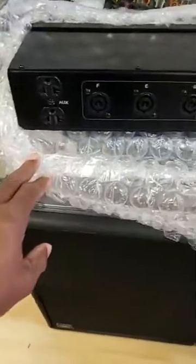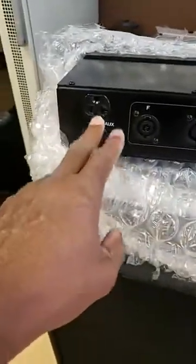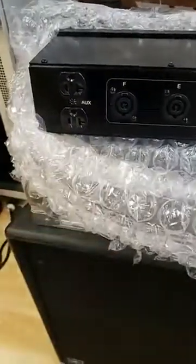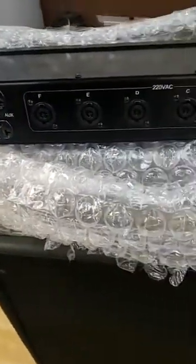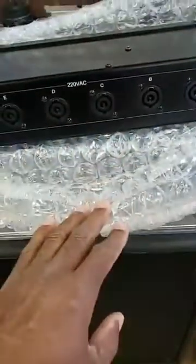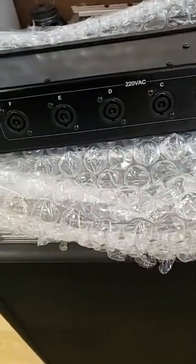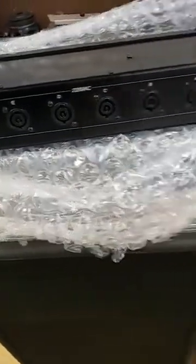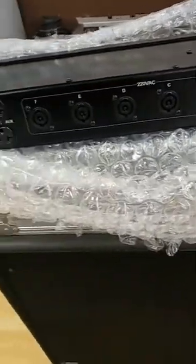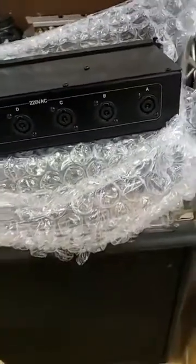For people that didn't see the first video — this is the back of the distro. You have your auxiliary, which is for your signal processing: EQs, crossovers, drive racks, whatever you may be using. Then you have six individual outlets all putting out 220 volts, which is the best way to run these lightweight digital amplifiers. You don't want to run them at 110 — that's not the right way to do it.